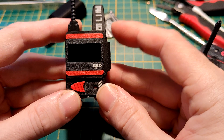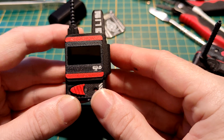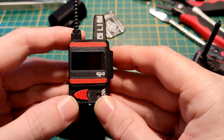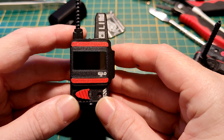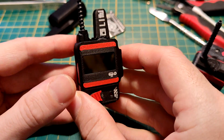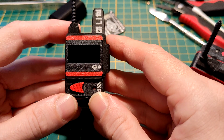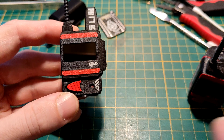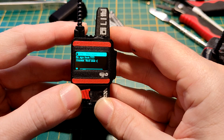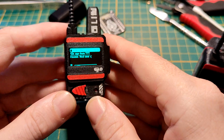I have to redo a little bit of the design because building the thing was a nightmare getting the wires all in there correctly. You really have to use thin wires — I used lacquer ones, 0.3 millimeter thick. The biggest issue was the GPS antenna cable because it is so long for the size of the housing — it gave me a really hard time bending it around, and I felt like I was almost bending it too much.